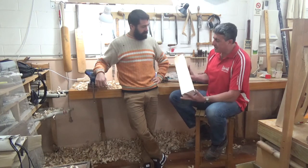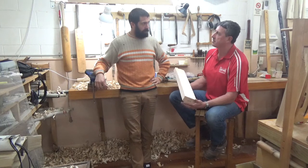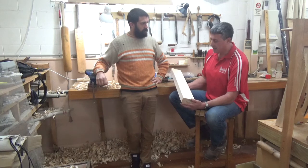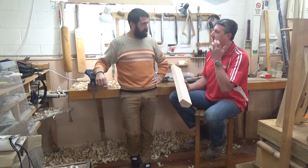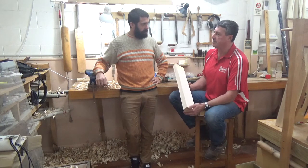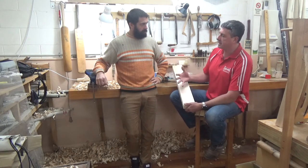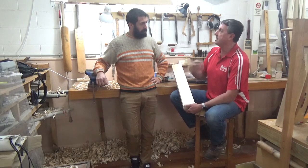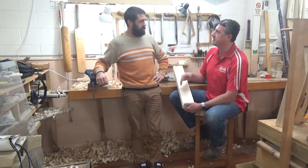So effectively, most pieces of wood that we'll work with, we'll look at between 10 and 15% moisture content. We have a drying cupboard that we use, and we'll try and keep the timber in there for a good few weeks before we make it, just to stabilise it. Because when we press the bats, we saturate them with water, and so it takes on the moisture again. So you've got to get that out and then regulate that before you actually finish making it.